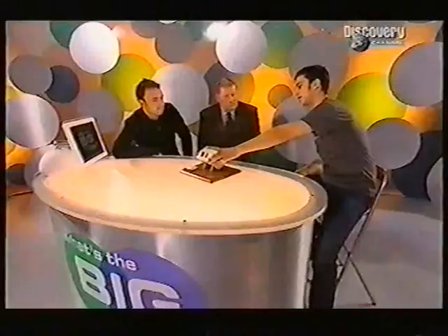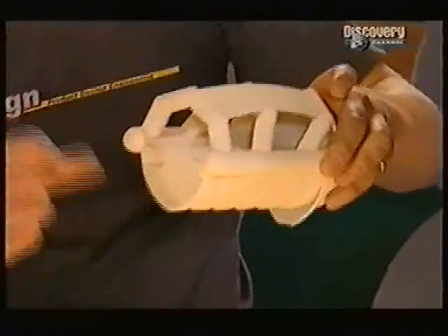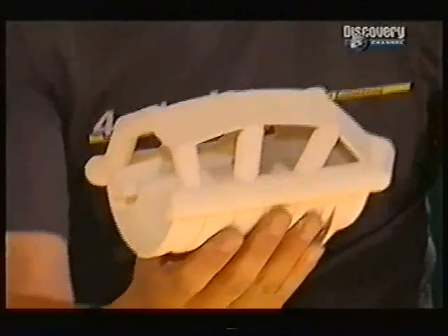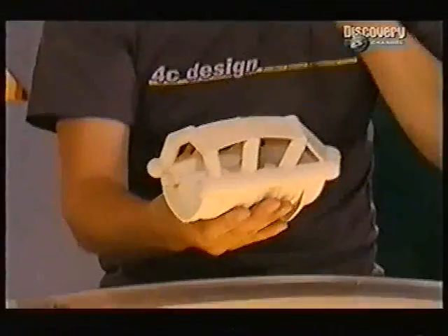It's pretty impressive to me. Peter, what's unique about this life raft? There are two major features that make it different: this keel section at the bottom here, and then the open-ended rear at the back. Upon inflation, this keel section floods with water. Once flooded with water, it creates a stiff keel for the life raft, with a combination of the floor and the keel section. What this extra water does is, in the unlikely event that it might get toppled over by a wave, it creates a high centre of gravity, so when it's upside down, it just brings it back round and rights the raft when fully laden with occupants.